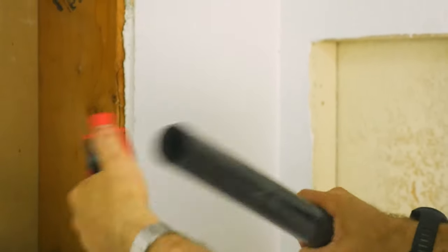This is a vent pipe and this is actually a drain pipe from upstairs. I'm going to ask the people upstairs to run their faucet and make sure there's no leaks, then we can put the drywall back on. Now we've got our pipes set so we can set our outlet. We're going to get rid of all this extra drywall debris, remove these nails, and then cut in some new drywall.